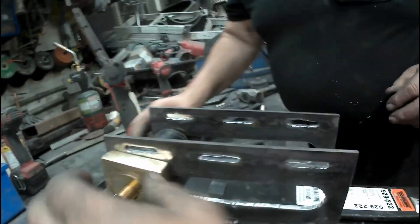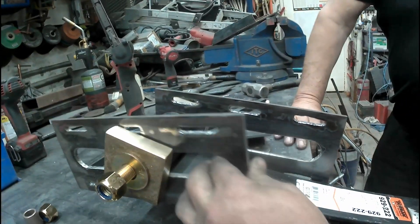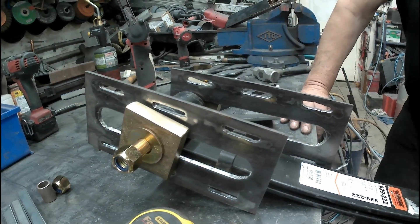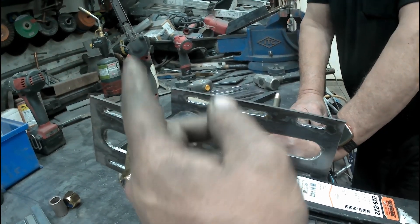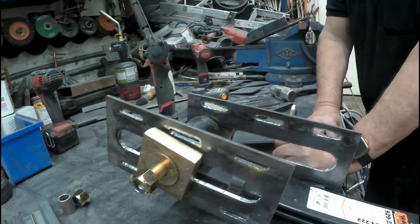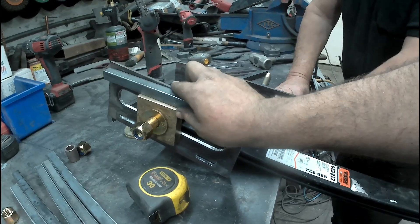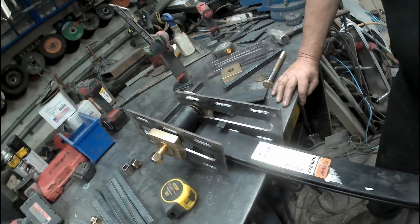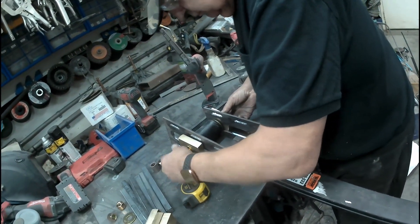You can sort of see the idea of this whole thing — this is the spring instead of the shackle. The spring will slide with ease on the guides there, and I don't have that three or four inch shackle height that I'm getting nailed on. We'll have one top, one bottom, and guide it. We'll figure out what we need and get some more parts in the morning.